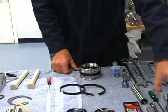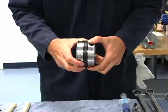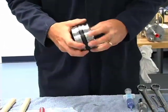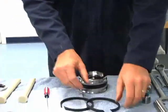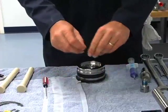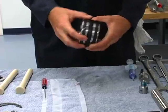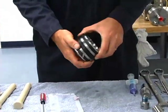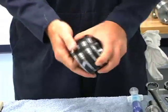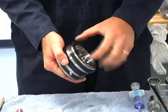So it's been a minute. Our center band is nice and formed back to its original shape. The retainers look good. Now we just put our wear bands on and our piston is ready to go. Please keep in mind, I only showed you to put the T-seal in on one side, but another T-seal does go in on the other side also.